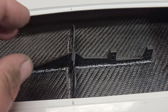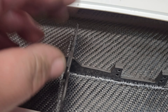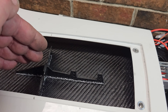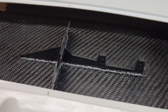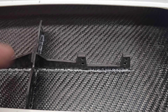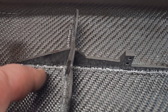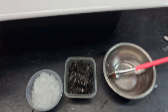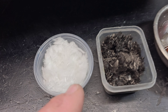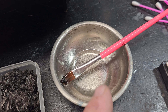So I got my motor mount — it's just epoxied in the boat. I used a 30-minute epoxy and just brushed it on my mount, set the mount where it needed to be, made sure it was in the middle level to the struts. Once it was dry, I took my Dremel and kind of roughed up the dry cured epoxy. Never lay down fresh epoxy on dry epoxy without sanding it — you must sand it. It's important. It needs something to bond to. Just cured epoxy is really smooth — it'll peel right off of it. So I got some chopped up fiberglass, chopped up carbon fiber, and that Venom carbon laminating resin. Also going to need some Q-tips.